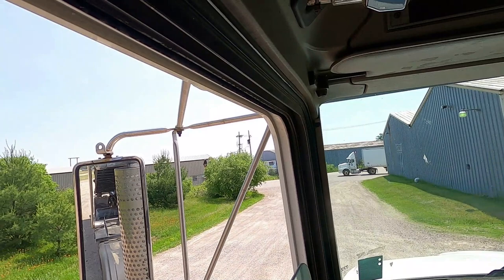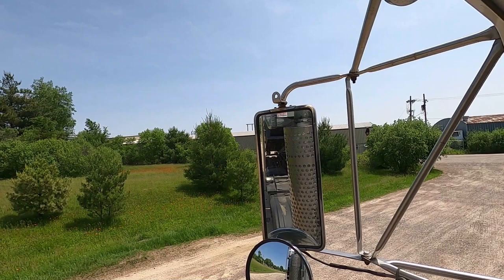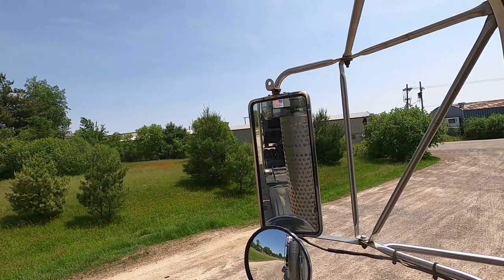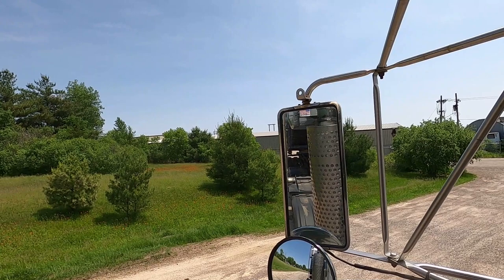Regular brakes, take your emergency brake off or parking brake off, and then sometimes if things aren't lubed up, the rails, well then she'll start pushing on the trailer because there's a lot of friction, and then if the brakes aren't really good, or if you're on ice or snow, it'll push that trailer right out, and then you're chaining the trailer to the truck to get it to hold on.